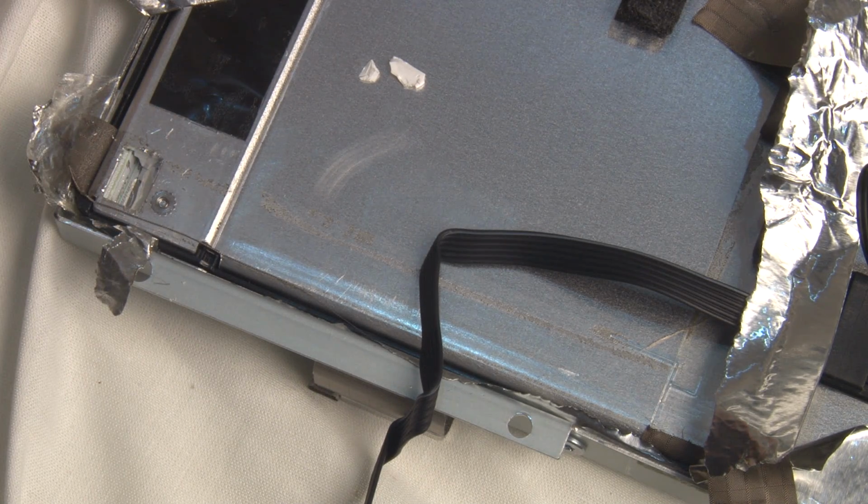Okay, it's really small in there. The pitch of the connector is about 0.5mm. Sorry, I think it's 1mm. Actually, I can just check that. So soldering it is going to be, yeah, it's 1mm pitch. So I need some magnification, my eyes aren't that good.